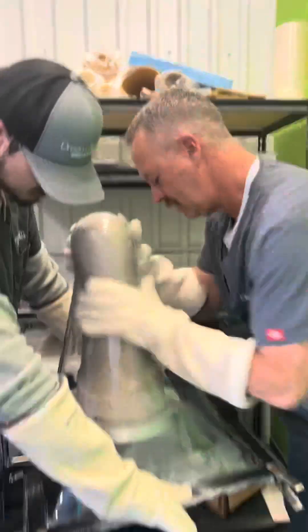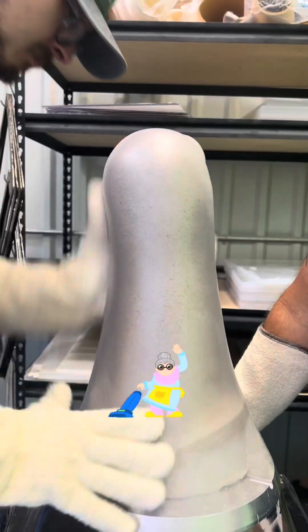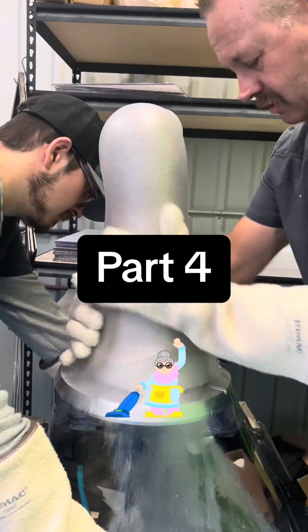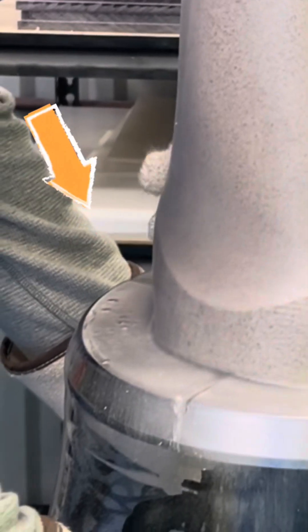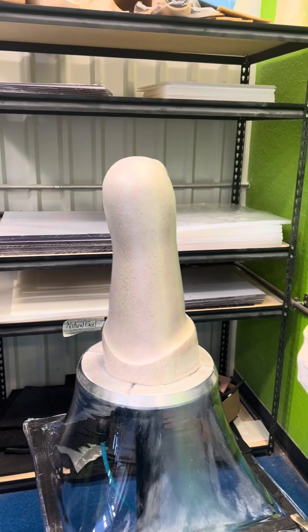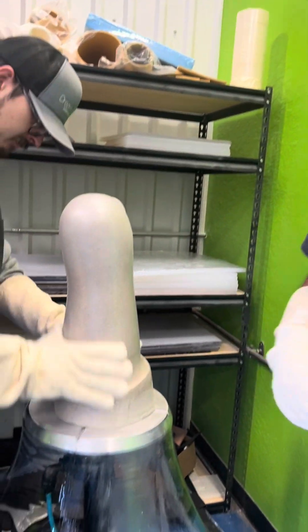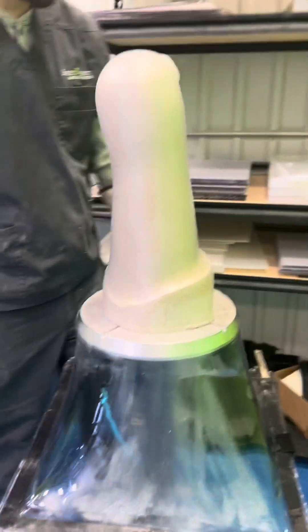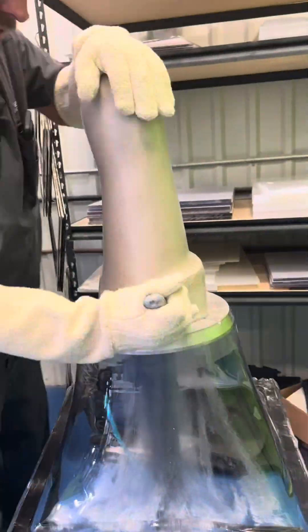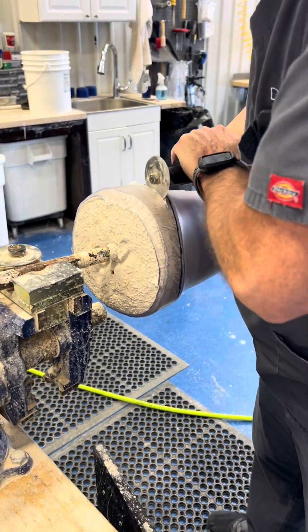Part four of how they make my prosthetic legs. They heat up a sheet of plastic and then put it over top of my stump mold. The piece down below pulls a vacuum - watch this little gap just disappear. In layman's terms: form-fitted plastic to a mold of my residual limb. We add the vacuum to it to make sure we get into all the various shapes and slopes. I have no idea who invented this but I am glad they did.